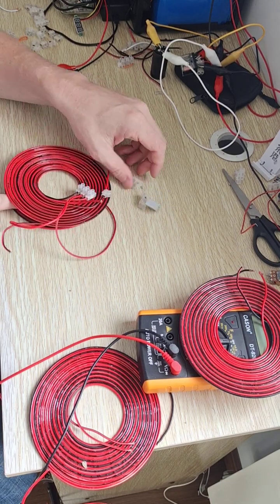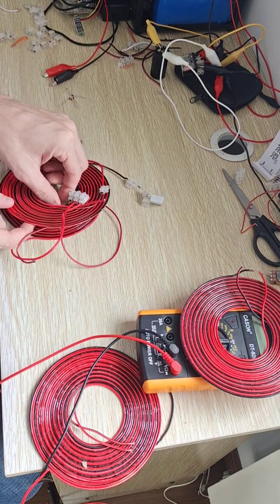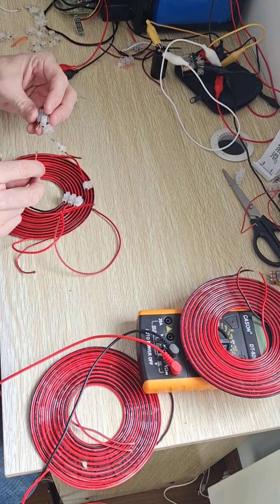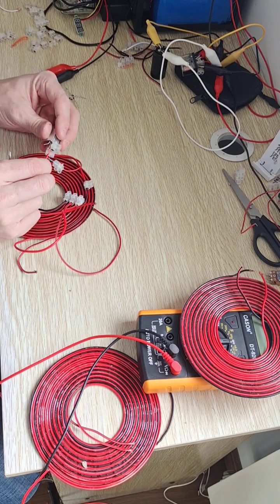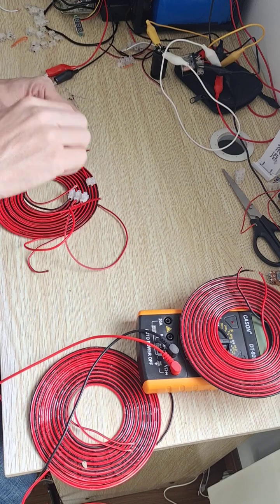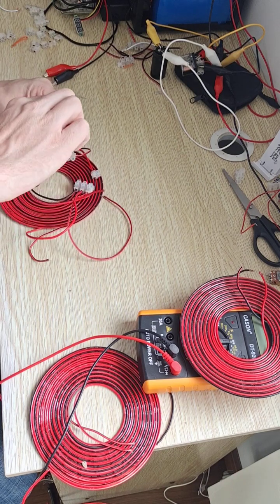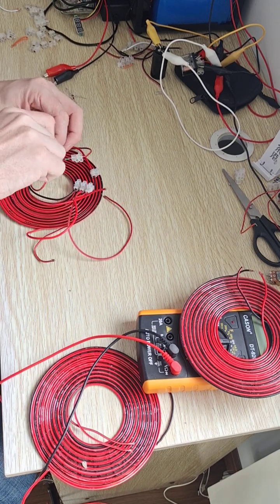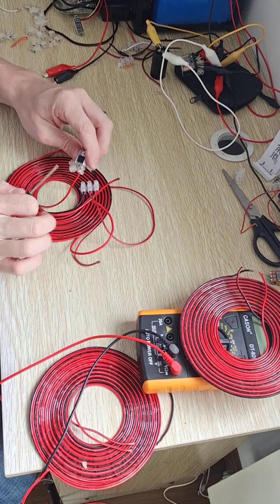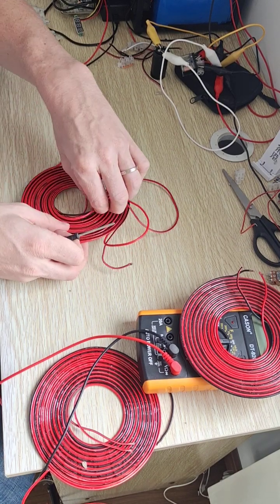So we've got the driver coil, with the resistor on the other end of the driver coil. This really gets complicated to see, isn't it? The other end of the driver coil connects to the middle pin of the transistor, which again, I put the diagram up so you can see what it is. I always get confused between collector and emitter. I should just sit down and bang it into my head, shouldn't I? And then the other pin of the transistor is going to the negative out. So that's fine, that's sitting there. Good. What have we got left?